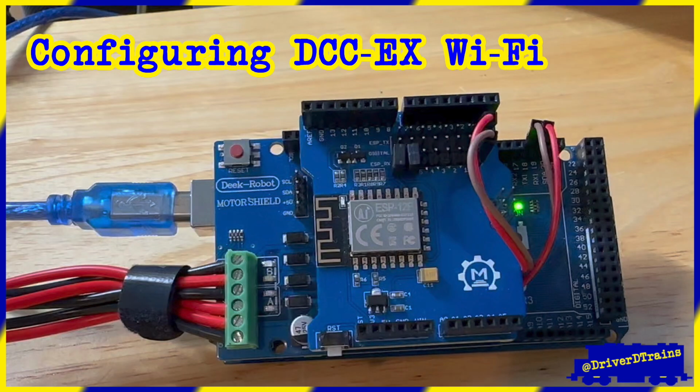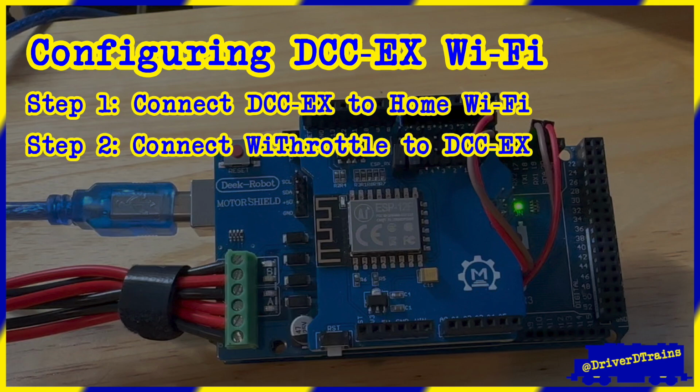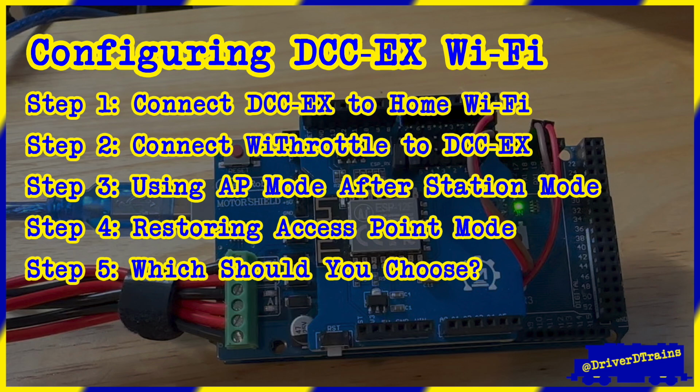Here is our work order for today. First, we'll connect DCC-EX to our home Wi-Fi network in station mode. Then, we'll connect the WiThrottle app to DCC-EX on our home network and try running some trains. After that, we'll learn how to use access point mode after the command station has been configured for station mode, and how to restore the Wi-Fi chip to the default access point mode settings. Then we'll consider the pros and cons of access point and station mode to help you decide which to choose.